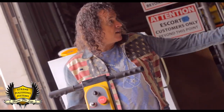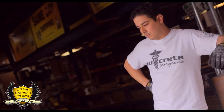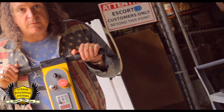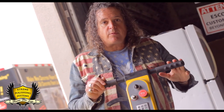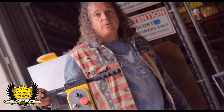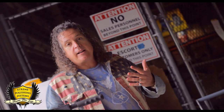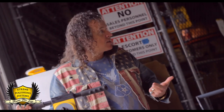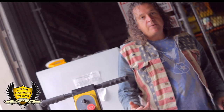Santiago Alvarez is the master mechanic at Xtreme Polishing Systems, and he's assembling the machines 100%. Anything that ever happens to a machine, he's the gentleman that repairs it for the company. So he knows this machine backward and forward, and he's going to take us through what to do when your machine doesn't seem to be running properly or you're not getting the proper speed on your plates on the bottom. It normally means that you have a loose belt or maybe a belt issue.